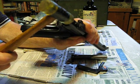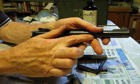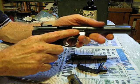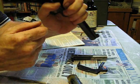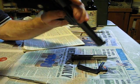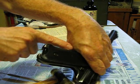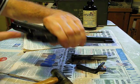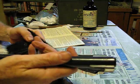You're going to give it a couple of good taps, and while you do so, what you're trying to do is separate the barrel and the receiver from the frame. You don't want them to go flying apart and drop pieces, so I wrap my hand around it like this with a little firm pressure to hold on to it when they separate. Also, because it's in the webbing of my thumb here, I'm not allowing the frame to go forward, only the barrel and receiver assembly go forward. They come apart like that.